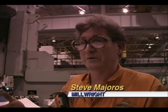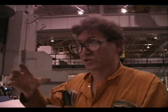With standard type presses, without vibro pads to be used underneath, now you're in a matter of setting up jacking systems that do not hold the tolerance as close as the Vibrodynamics system. So you can control every corner. The Vibrodynamics people, they know which corner we have to raise or lower, and there's a screw in there. It's amazing how it'll raise it.